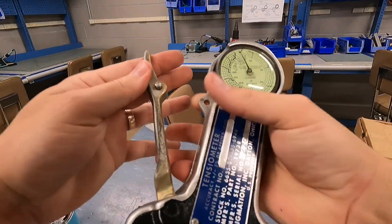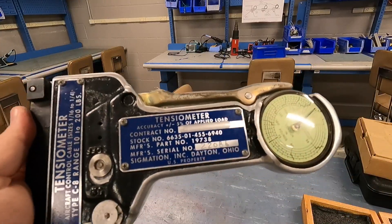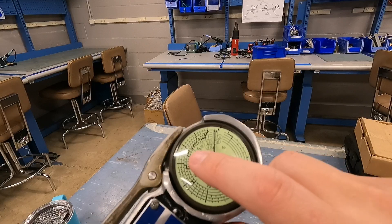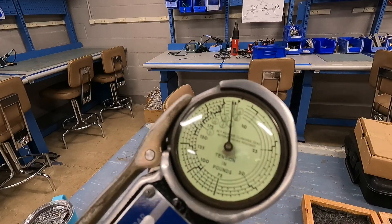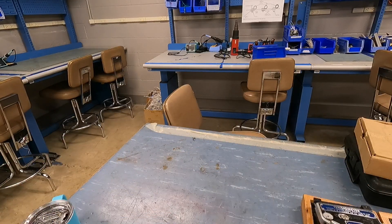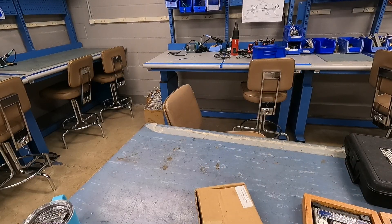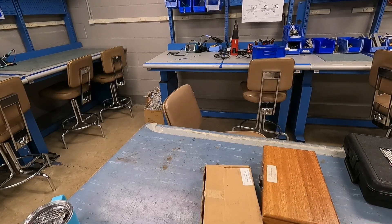This one has a little lock. It's a very nice tensiometer. If you were doing serious maintenance at a full FBO working on a lot of aircraft — especially heavier aircraft with bigger and smaller cables — this is nice because it handles 8 different cable sizes all the way up to a quarter inch, and a quarter inch cable is very, very big. This cable tensiometer here only does 3 cables — it's the cheapest but it only does 3. That other one does 5. But this one does the most. If you're working a serious FBO, it might be wise to invest in something like this for your company.